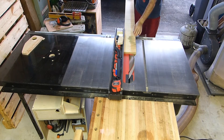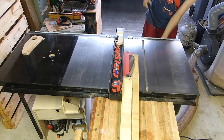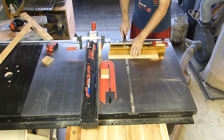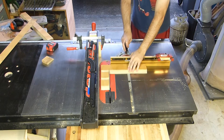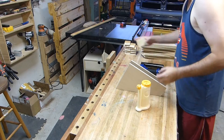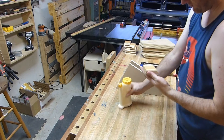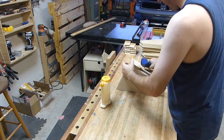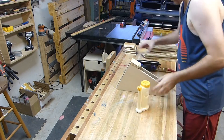I take a piece of three quarter inch plywood and make a French cleat, ripping it at 45 degrees. One half of that will be mounted to the wall, and here I'm cutting up the other half, which will complete the back of the brackets for the clamp rack. I'm putting glue and shooting a brad nail into the back to hold it in place. You want to make sure the bottom is angled the right way to be able to hang it on the French cleat.